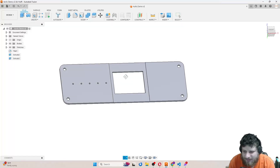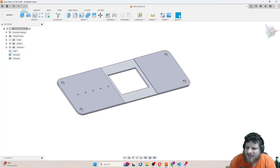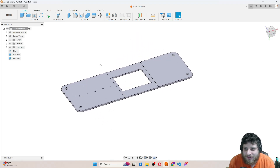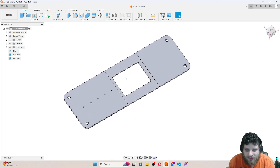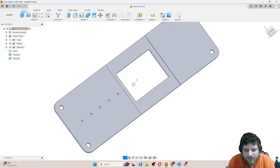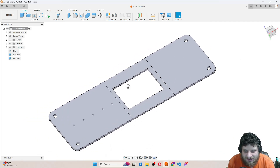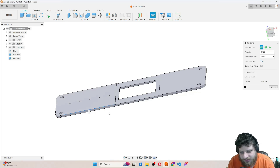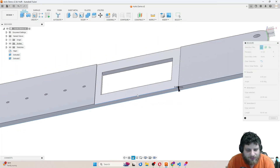This is not quite my actual part — I can't show you the real part I'm shipping to the customer, but this is a pretty good imitation of it. The customer didn't actually provide me with a real drawing; it literally is just a CAD model labeled 'cap.' So I'll assume everything is plus or minus three thou, which is my shop tolerance. The part is one millimeter thick at its thickest and 0.83 millimeters on a thinner section.